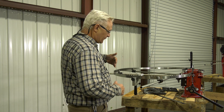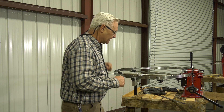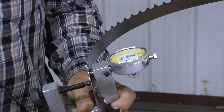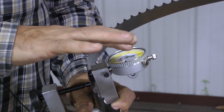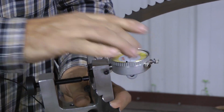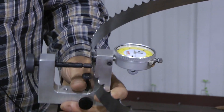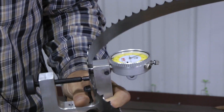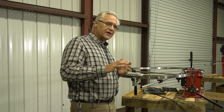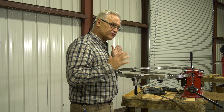If I come over here in the curve — this is where your band wheel would be, and this is more your straightaway we were showing. If I clamp this and zero it out, watch how much that moves: 10, 12, 15 thousandths on this dial indicator. And if I really tighten it down super tight, you can see my zero change a little bit. It's still moving quite a bit — I've got it as tight as I can get it. You can see that a little bit of flex in your blade is affecting these thousandths we're talking about. So we want to get it at the best place — that would be in the straightaway.